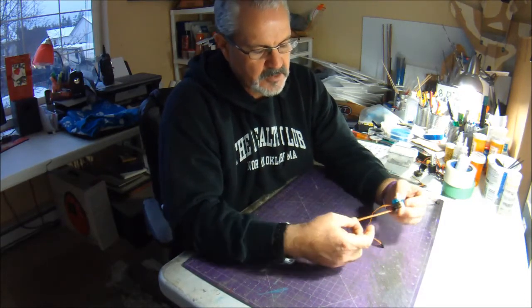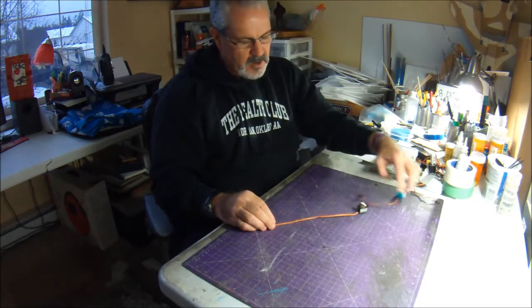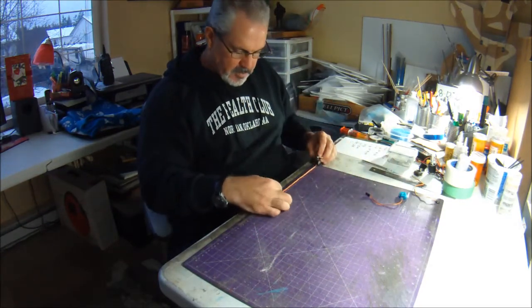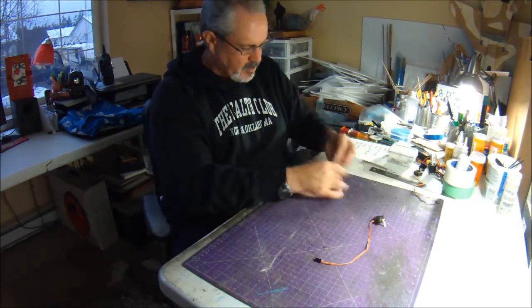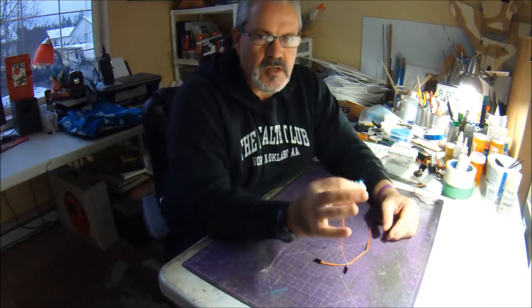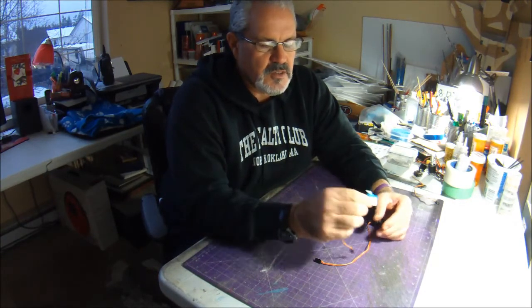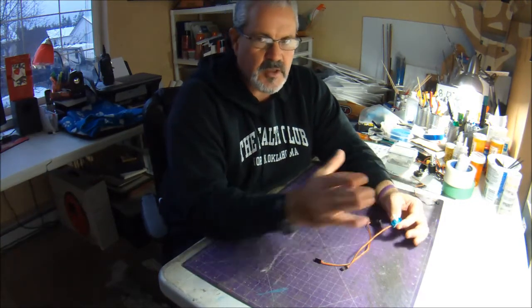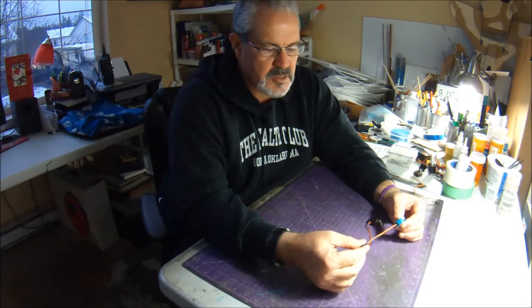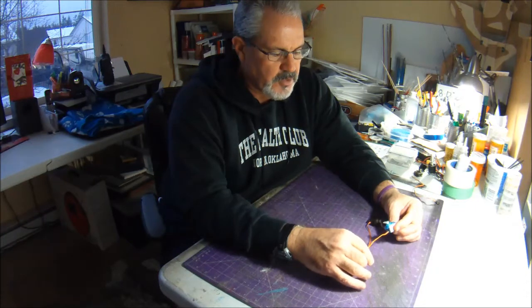so that's why they have the full length arm on them. The other challenge is, you'll notice there's a big difference in the wire. On the 9-gram ones, they're about 10 inches long, and on this 5-gram one they're about 6 inches long. So you have to be a little bit more careful where you place your servo, otherwise you have to add servo extensions, which then add weight back to your plane, if you're looking at really keeping it light.